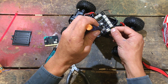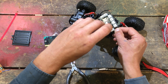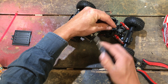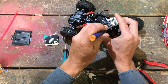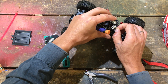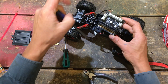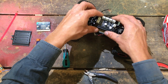You can see it's clearly marked on the edge connector — minus and plus. You'll need a flat screwdriver to open the terminals. Screw it in real tight. Sometimes it doesn't open enough so you need to push the wire in with the screwdriver to get it seated. Power is connected — and again, don't forget to remove the batteries while you're working on this, just to avoid any incidents while you're wiring the circuit.